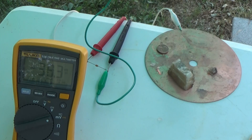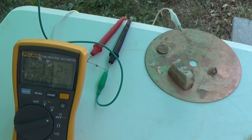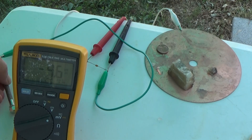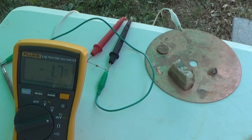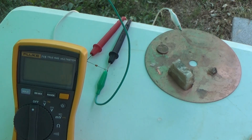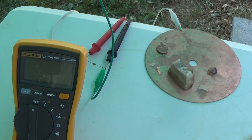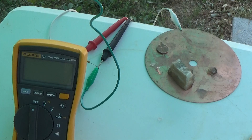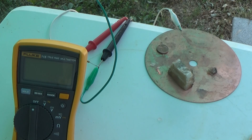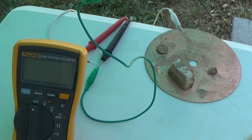So there's a back-to-back diode. The crystal is the anode; the copper plates are the cathodes. What our circuit is doing is taking the radio waves — the RF — in this case it's the FM radios from across the town — coming into this antenna, being rectified by our crystal. So only the forward-biased energy is going into our cathode.